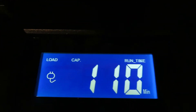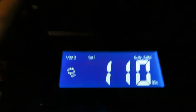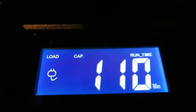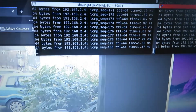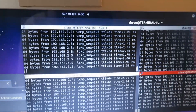I'm also using my CCTV camera which has a date and time stamp, so we can confirm that when we come back online the CCTV is continuing to tick over. We're going to flick the switch now and turn it off, so it goes from load on the mains and switches to battery — we're now running at 230 volts. Spinning around, all devices are still pinging through, the time on the CCTV camera is still ticking by and still capturing video, and all ping tests are running perfectly. That's a successful backup — the UPS is doing exactly what we asked it to do.